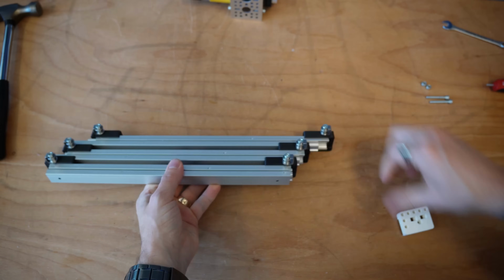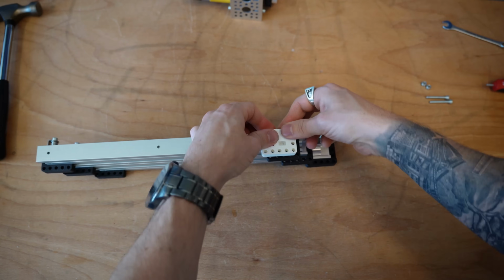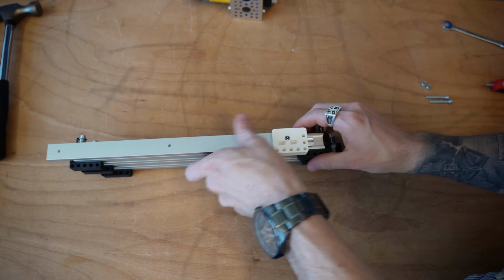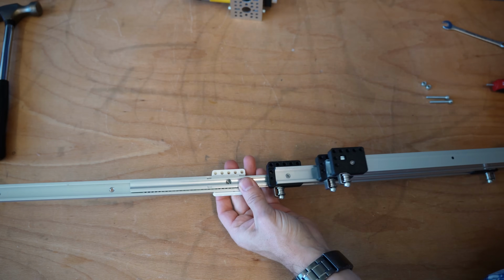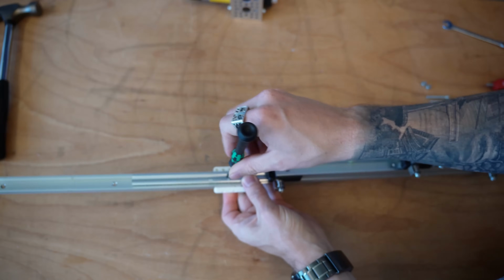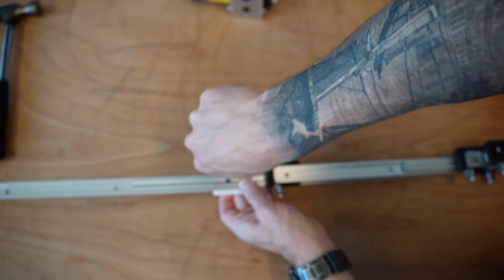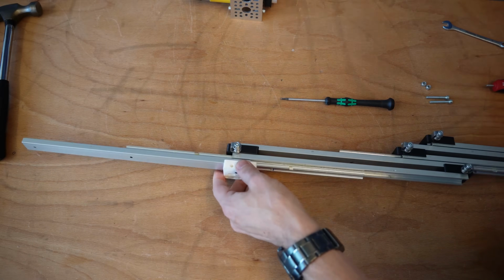Now again, we're going to have to mount this at the bottom of the last stage. So we're going to mount it on like so. Put on our M3 lock nut. And our last 8mm screw to hold that in place. Thankfully, 3D printing technology has gotten so fast now that you can print something up and done realistically in about 20 minutes, which is great.